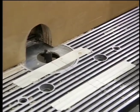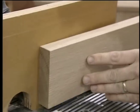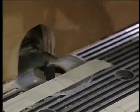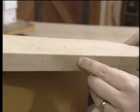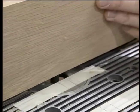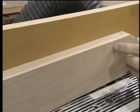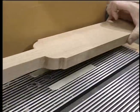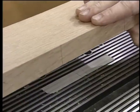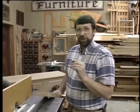I'll show you how to make the mortise over here on the router table, set up with a half-inch straight cutting bit with indicator marks and tape to show the leading and trailing edges of the bit. For the short mortise at the top, I lead into the bit up to the first indicator mark and stop. For the longer mortise in the middle, I drop down at the trailing edge of the bit, push it through and remove at the leading edge. There's one more mortise along the back side of the leg. Because this white oak is so hard, I'm only removing about five-sixteenths of an inch at each pass.